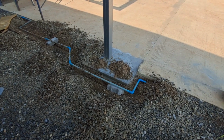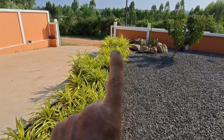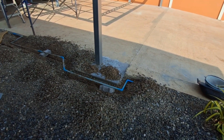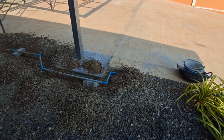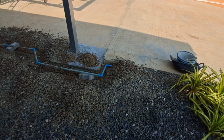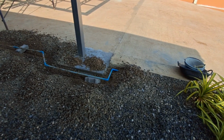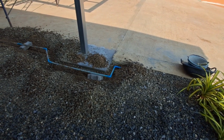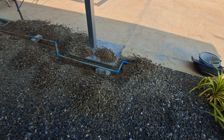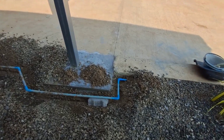Yes, I didn't think about that, did I? Because I haven't run that tap down there since refitting the pipes. So there could be an airlock, couldn't there, thinking about it? If there's an airlock in the pipe between this joint here and the tap, that could be affecting the way the pressure's measured by the pump. It could be pressing the air down as it pumps up to give it the pressure in the pump, and then gradually the air expands again effectively and changes the pressure. So it could be that, I suppose.